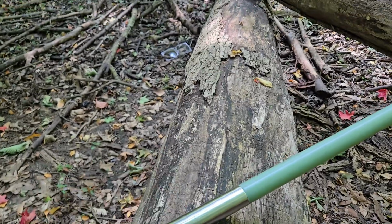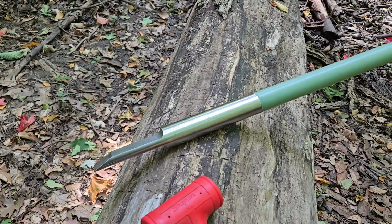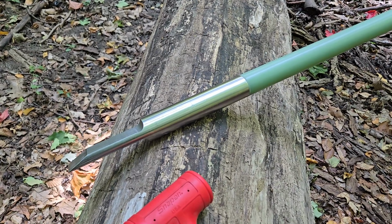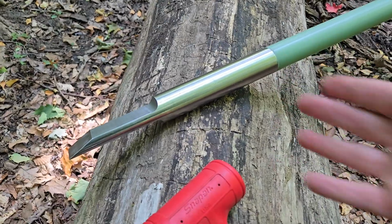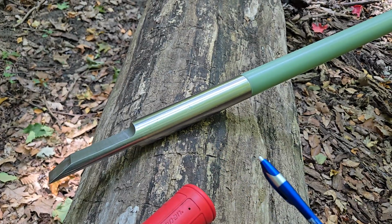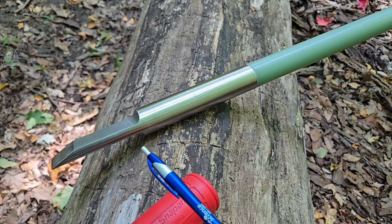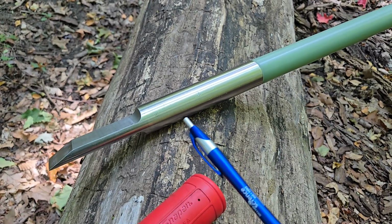The reason why we've done this is because a lot of times when you see guys forming chisels, they're constantly heating it and cooling it down, and the metal is not consistent once it's heated. It's got basically high spots, and that can cause cracks. The tool steel that we've chosen is specifically designed for hitting dies and metal continuously 24/7. This is why they use this particular grade in the tool and die industry. So it's not going to chip on you, it's not going to fall apart like our competitors.